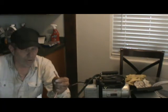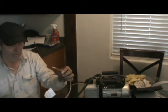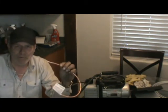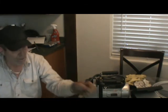Okay? That's why you can't get your solder joints perfect. It's because you're using a wire brush possibly. You're not cleaning the end of the tube. Okay? Which is really the most important part of it. That's where the solder sits. You don't see solder up here when you're done, unless you're really screwing up. Okay? And I know a lot of guys do find that because you're heating it so much because you didn't get it clean.